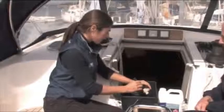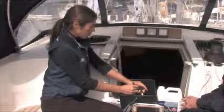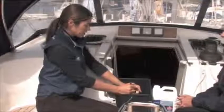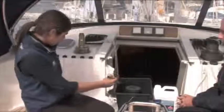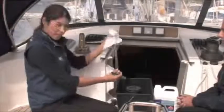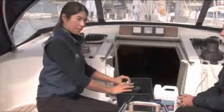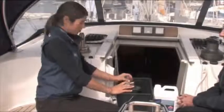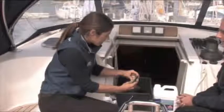I'm just sort of flicking in here. One thing to note from my experience: when you're brushing, do it deep in the bucket because the little bits of grease are dark and they will stain on the teak. Note that we've put some plastic down and we've got paper tissue to hand, so we're preserving the boat as well as servicing the winch.